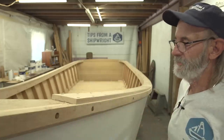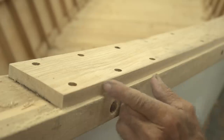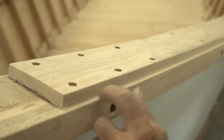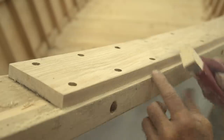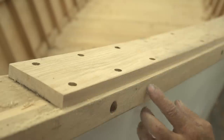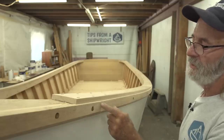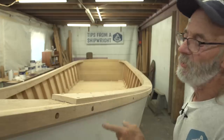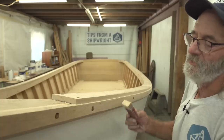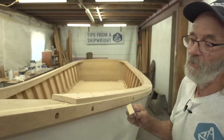I've done a little bit of sanding on both sides — the outboard edge of the cap or covering board and the top of the guard all in one sweep, because the paper was touching both as I sanded. I'll have to come back later and break these edges, because a real keen edge won't hold finish well. I'm trying to do it in order so I don't forget what weight of paper I'm using — I'll get it all done once, then switch paper and do it all in order again.